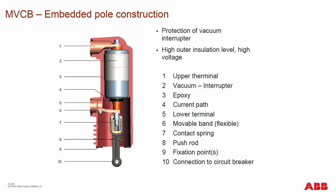Then there are the contact spring forces. The important point about contact wear: there is an extra four millimeters of travel built into the spring. Our contacts in our vacuum interrupters are designed to only wear one millimeter within their entire lifetime. We put in an extra four millimeters of travel, leaving another three millimeters available should something occur. This is designed for the life of the breaker so that no adjustments or measurements of the vacuum interrupter are required while in service.